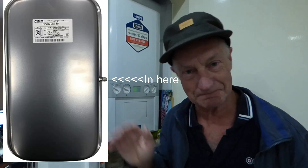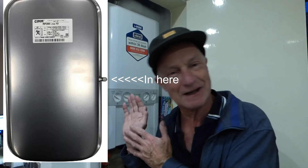If you find you are getting this huge jump, it does mean there is a problem with the expansion vessel. There is a valve on them, a lot like a valve on a bike or car, and you can actually fit a pump on there and pump air back into the expansion vessel, because it may have deteriorated and escaped. But it may have happened because the vessel is rusty, or the rubber diaphragm inside has corroded and rotted. It's worth trying — you can pump the air back in — but I wouldn't suggest you do it on a combi boiler; you really need a technician for that. On a sealed system with a pressure vessel above the cylinder, you can actually do the pumping yourself.